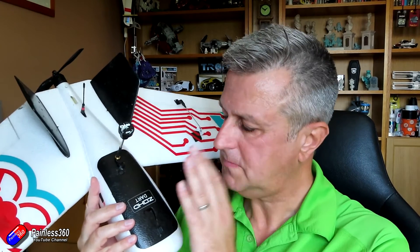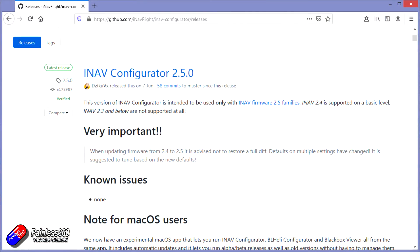Hopefully that's been interesting for those wondering what to do after the maiden flight. Those are the two things I do: once you've got the servo auto trim done and the auto tune done and saved, you're in a really good place. One last tip: go into iNav and do both a dump and diff in the CLI and save those files somewhere safe. That is now the reference settings for this model, and if you upgrade iNav in the future you could save yourself the whole servo auto trim process by plugging those numbers back in. But always be careful when upgrading iNav — occasionally they'll tweak how the PIFF controller works, so plugging old numbers back in might not be a great idea. Always check the release notes when iNav is updated.